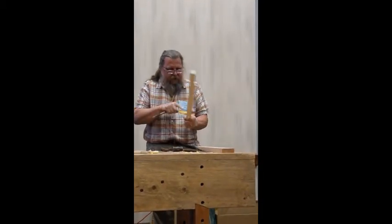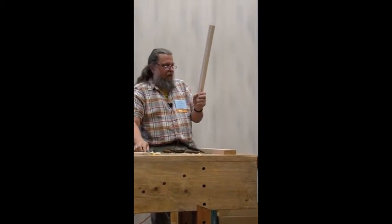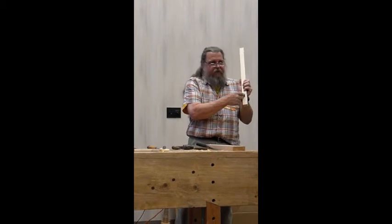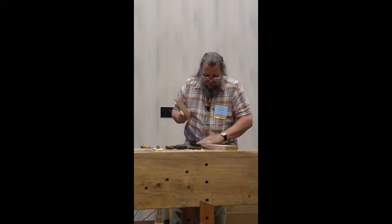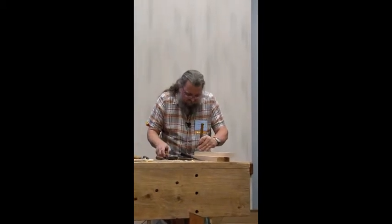Again, you want those nice and flat on the inside. Pressure this way will split. That's just a wood problem. So now I've got that. I want to come back and do this mortise, this little haunch part here. So I just line this up.